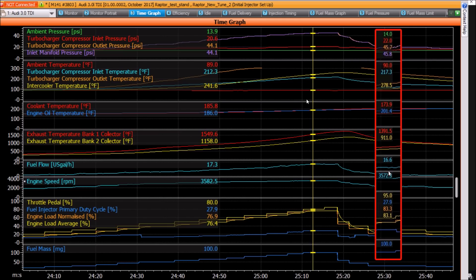So it's actually doing kind of what I hoped — cooler temperatures, lower boost. Here's the EGT: 1540 is the actual EGT, and 1158 is what's coming out of turbo number one. On the previous run, 1391 was coming out of turbo one and 900 out of turbo two. So you have to compare that 1390 to the 1158 to be comparing the same things — and we've actually got cooler temperatures coming out of the first turbo now, which is good.